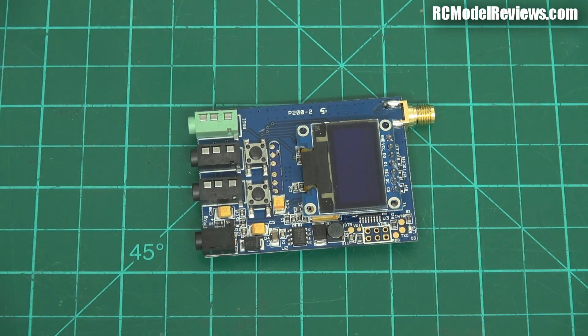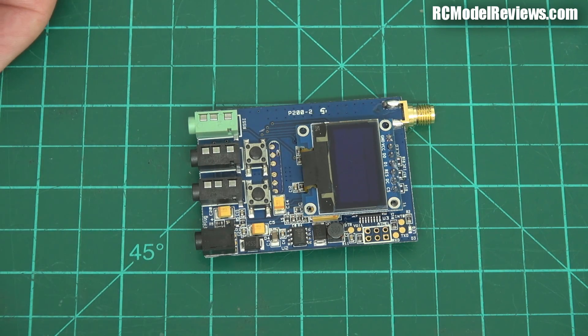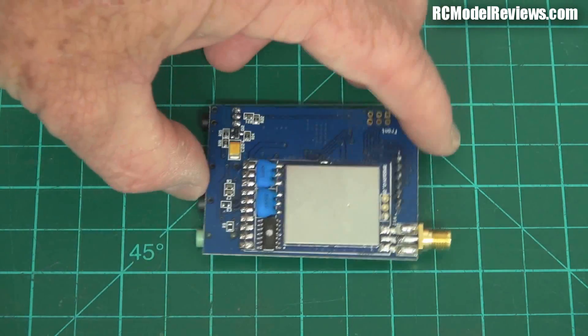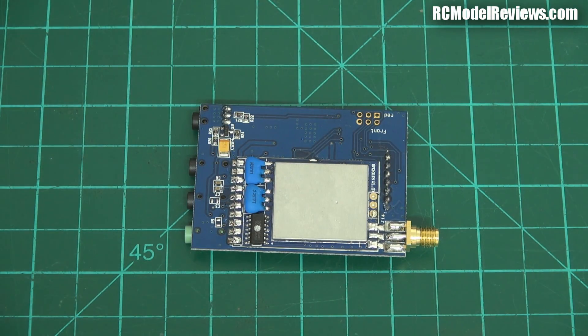I know some of the older receivers, the RC305, they use a linear regulator — just a three terminal regulator — which means they get really hot if you run them on three cells. This will not get nearly so hot, and your batteries will last longer with that little switched-mode regulator. On the back, we've got the RF goodness and everything's in this module. They're claiming minus 96 dBm receiver sensitivity here — that's quite a high sensitivity. It'll be interesting to see how it actually performs in the field, considering that virtually all of these things use the same module.